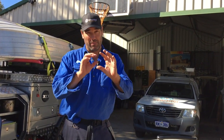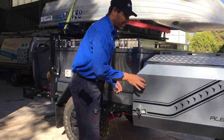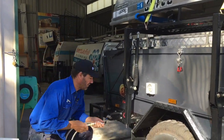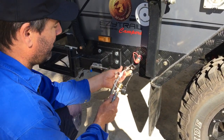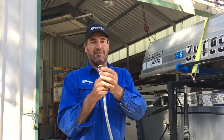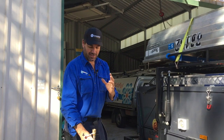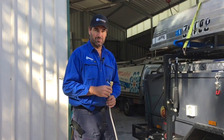Okay, so we just grabbed the hose for the hot water system. It's a slightly shorter one — it doesn't need the length; it's best to keep them as short as possible. So you can see over here, we've run a new gas main all the way around over here. It locks into this bayonet here — it's got its own little dust plug. Just pop that out, put your gas bayonet link in, give it a slight twist. It's a quick release fitting — no gas is going to come out of here. Now when that boat loader's out this way and the hot water system's hung on, click straight in — you've got gas to the unit. And then he's got a plug in here for the water to sort it out.